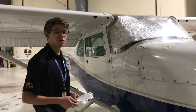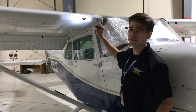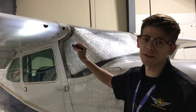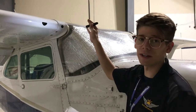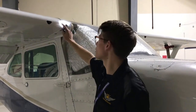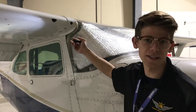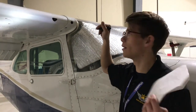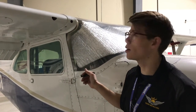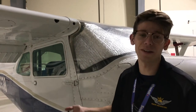Next are our overhead cabin inlets. Think of these as basically your air conditioning inlets — small airplanes don't have air conditioning, so this is what you get. The inlet to the rear seat is right here and the inlet to the front seat is right here. We're checking for any possible wasp nests or foreign objects that could be clogged in there. Remember, it's a direct airflow to the cabin — if there is a wasp nest in there, you're going to get an influx of wasps into your cabin. Not a fun day.